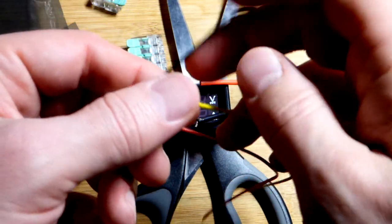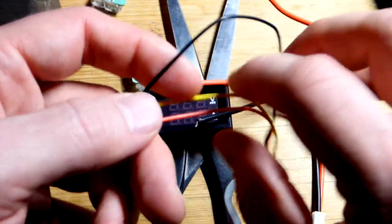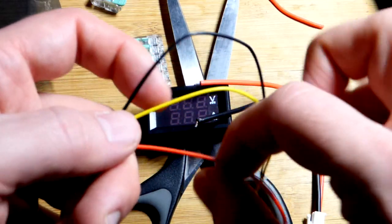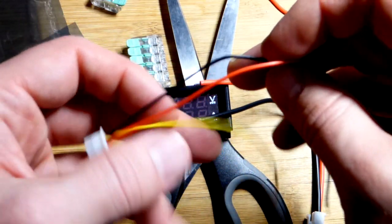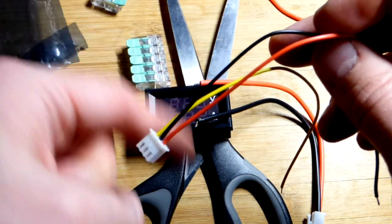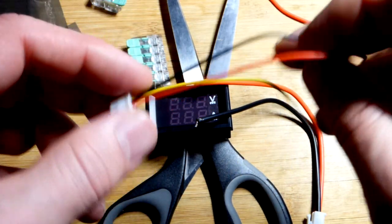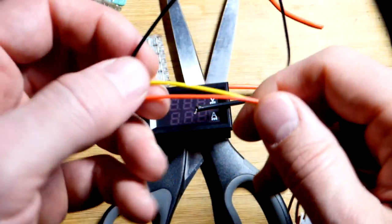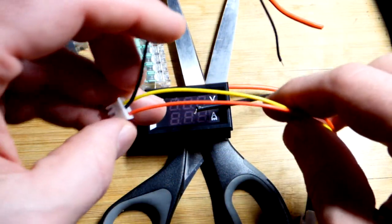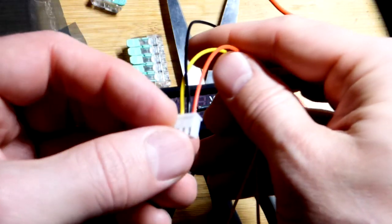Be aware — you'll get short circuits if you connect that black wire when using a single supply. If you're going to power this meter with a separate power supply, you would put these two wires to that supply for the meter and the rest to a different power supply. That's more complicated, so we're not going to cover that. If you've got a single supply, which you probably do, just don't use this wire.